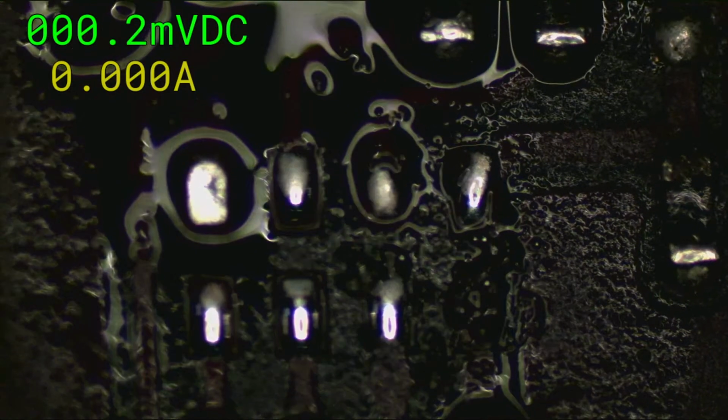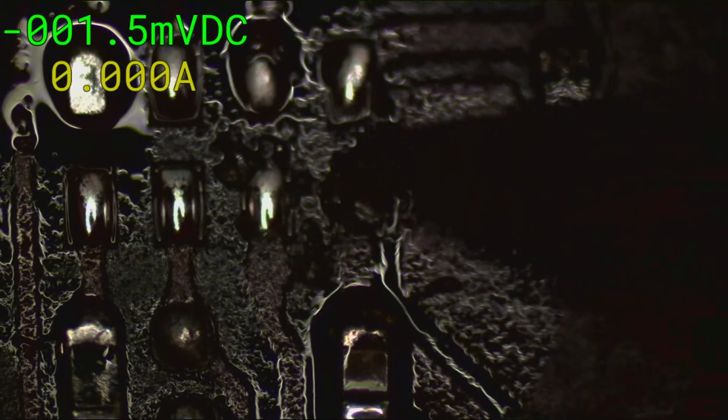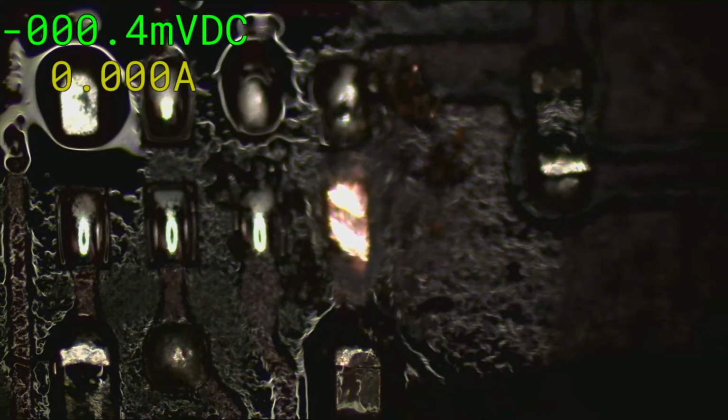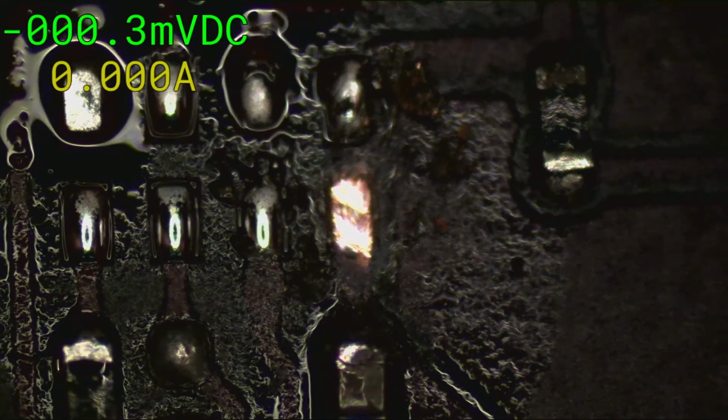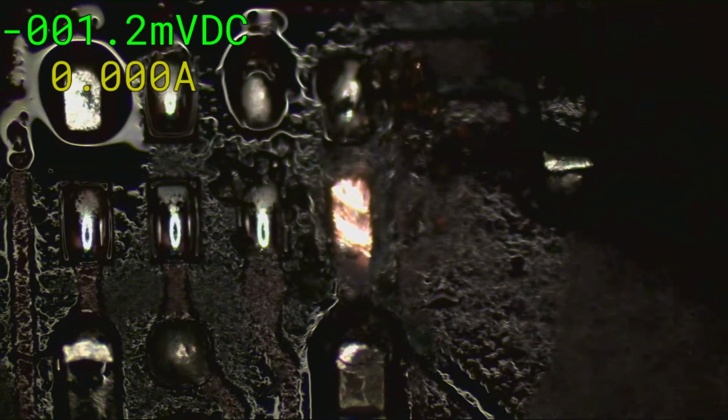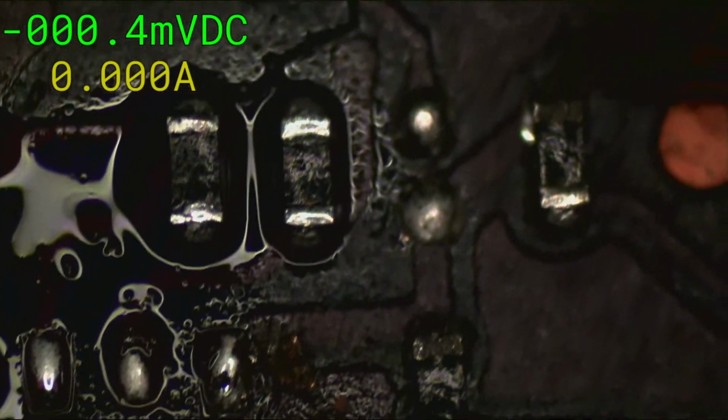So PP3V42 is just done from here. Take an X-Acto, let's do a little scrapey scrape. Ooh, there might still be a pad under there. All right, we got a pad. And that capacitor looks okay too. It didn't wear away its solder. This needs some new solder. This needs some new solder.